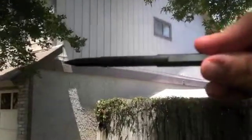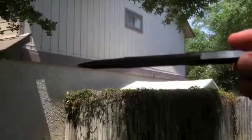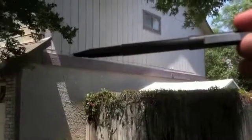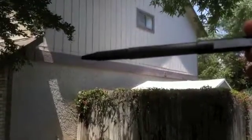And then we're going to wrap the face, put a facing of Hardie over this beam and drop it about 1/4 inch past the bottom of this beam right here, and then put flashing on top of the beam and drop the flashing edge just about 3/8 of an inch over the edge of the Hardie to give it a nice drip edge on top, so you don't get any deterioration or rotting on the top of this band board between the stucco and the siding.